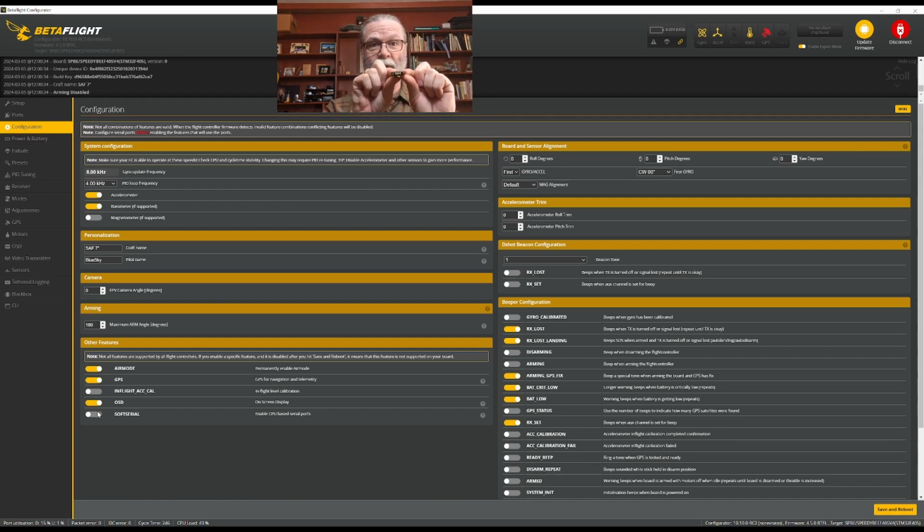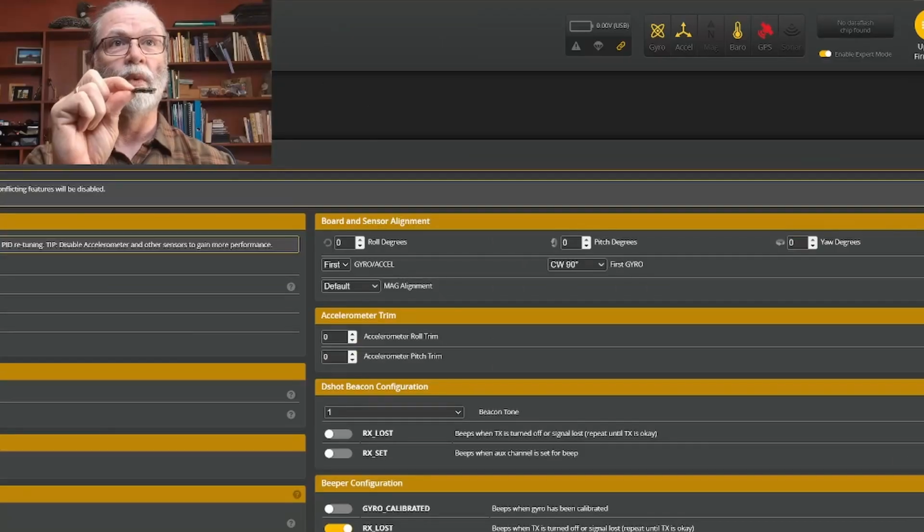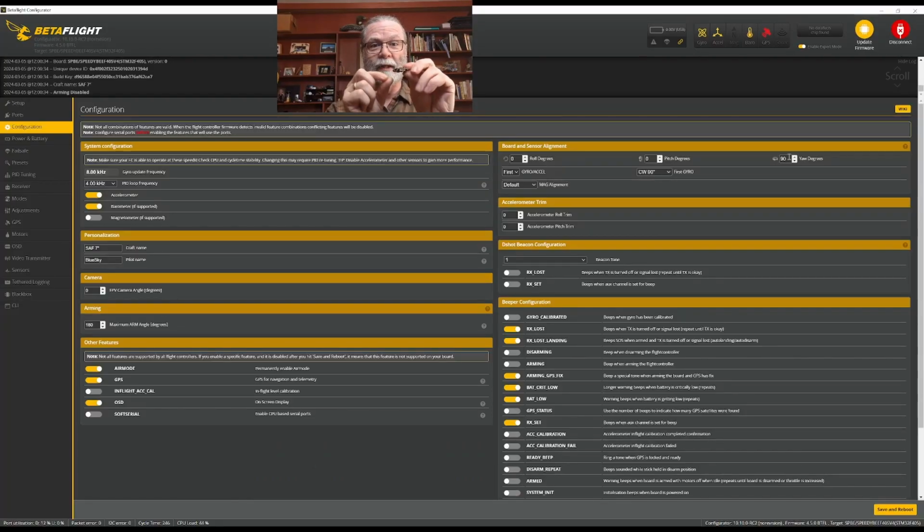that, for some reason you needed to mount it 90 degrees at an angle, which in this case is a 90-degree yaw, we would need to come over here and indicate that we had done that. If you had switched it and put it this way, for some reason, that's the only way you could get it to fit in your quadcopter, well, that would be a 90-degree pitch.